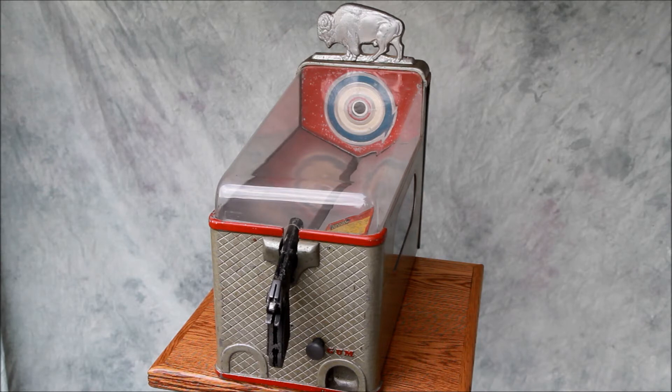The way it works is it's a completely mechanical system. You cock the gun and use the actual penny as the pellet. Take aim, and if you hit the bullseye and the penny goes into that center hole, then the penny is returned — there's a little funnel system in the back and a slot on the side of the game where you can get the penny back. If however you miss, which is the most common outcome, the penny ricochets off the back and falls into the center funnel area, where it then gets put into the gum vending mechanism and you can pull the knob on the front and have a gumball vended.